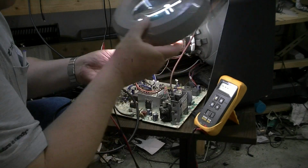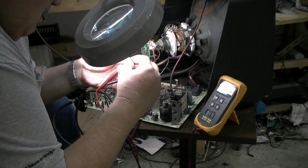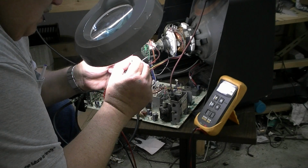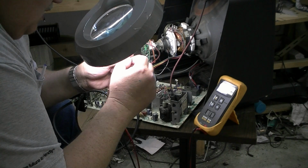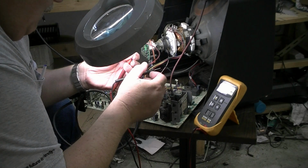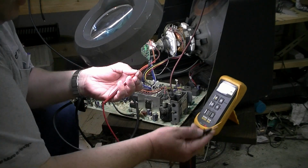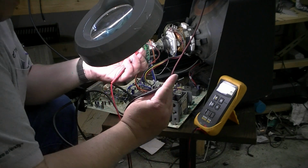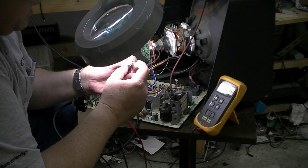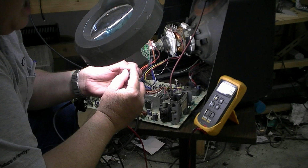But the color code on this thing is brown. Looks like brown gray. It's hard to tell. Brown slate. Yellow. So that would be what, about 190K? 180K. I forget my color codes, guys. It's been so long. I work in the telephone industry now. We use color codes for our pair colors, but our color codes are totally different than what it was for resistors. But as you can see, it's 10 megs, and the fourth color is 4, so there's going to be 4 zeros. So what, 180K, I guess?